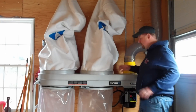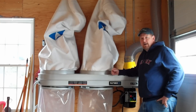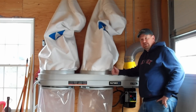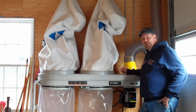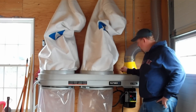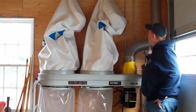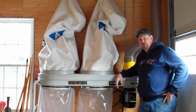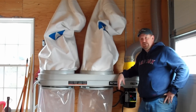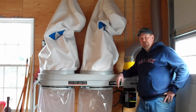The original dust collector comes with a port on top that you can basically hook up four 4-inch hoses to. Because my shop is upstairs, I actually wanted a large trunk line running up there, so I modified it. Kids from a local trade school welded up this custom reducer for me. I've got a flexible hose hooked up, and then a main 6-inch PVC trunk line running into the shop. I'll talk about PVC versus metal and all that in another article — there's tons of controversy on it, and I have my own opinions after doing a lot of research.